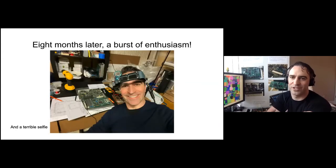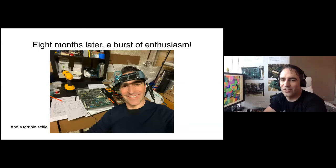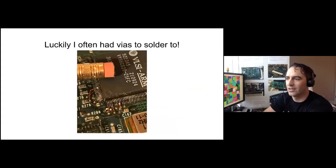One evening in January — about 10 months in — I had a burst of energy, buzzed out every ARM3 pin, and repaired the other 11 pins on the ARM3 that were connected to damaged tracks. The most concerning one was the DBE pin, which is what the MEMC uses to tell the CPU and RAM not to both drive the bus at the same time. If this one's bad, you're very likely to have a bus clash and just start destroying chips. I went through each pin one by one using printed bits from the VLSI datasheet. I crossed off all the FPA ones — I didn't even want to try that. But there were lots and lots of open circuits. Luckily a lot were actually still okay. Most of the time I had vias to solder to. My micro-soldering is not that great, but it was good enough to get things connected without shorting.